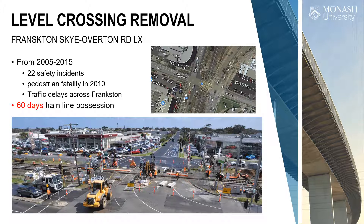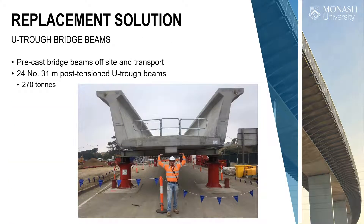This was an up-and-over solution. Initially it was to be a more traditional bridge deck made of super T beams — precast, pre-stressed concrete beams. But when it went to public consultation, the structural depth plus the train depth was too deep in terms of visual impact on the community. So the choice was made to drop the train inside the structural depth, ending up with a U-shaped trough to carry the train.